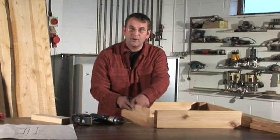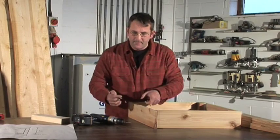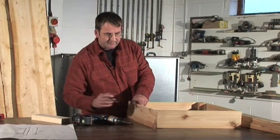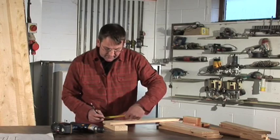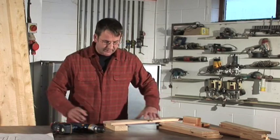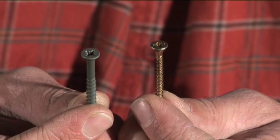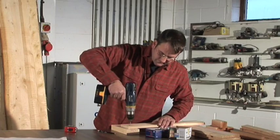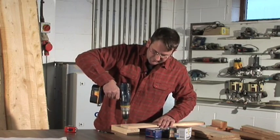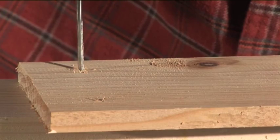If I just put screws wherever I like, there's a fair chance I'm going to miss. So I'll put it back on, measure the holes, and go from there. I've put the rough holes where I need them - get a tape measure. That one there is 25mm. We've got all our measurements on the side there. Get the screws that we're going to use - we've got two different types of screws: one's got a shank on, one's threaded all the way through. We will use the one with the shank on. Drill into a block of waste wood, which will just save the bench or whatever you're using. And there we are - we'll just replicate this through.